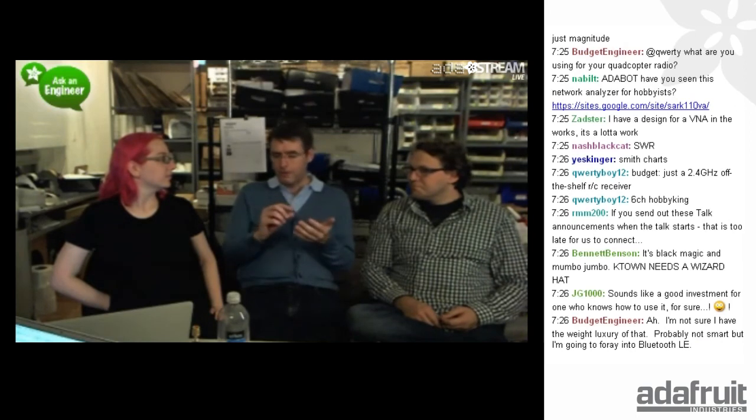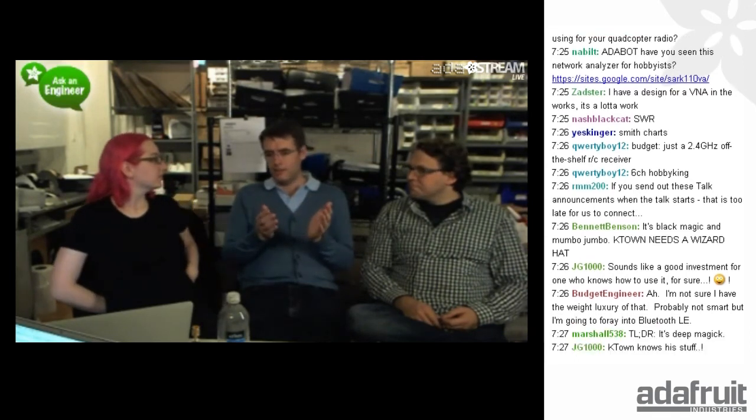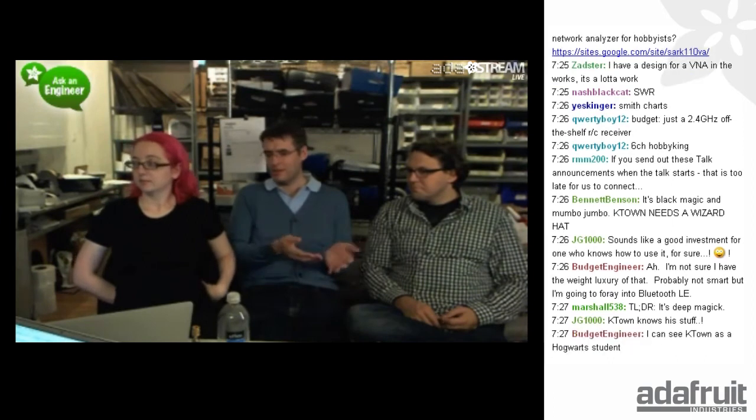There are calculators where you can plug in and say, okay, I'm using FR4, 1 ounce copper, 1.57 millimeter thick isolation, and it'll tell you, okay, at 950 megahertz you need a 70 mil wide trace. That'll get you close to what you want, but there's always some variability, and if you really want the maximum range, this is the only way to really get that. Otherwise you just lose the energy.